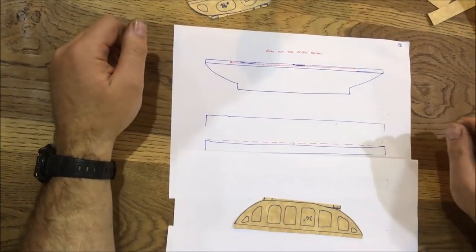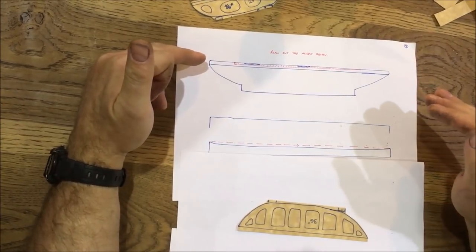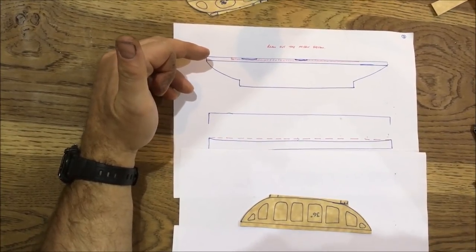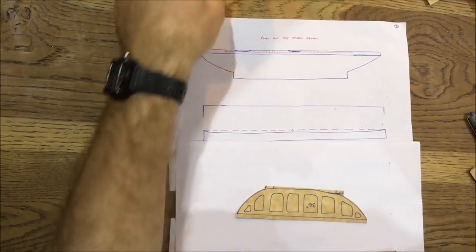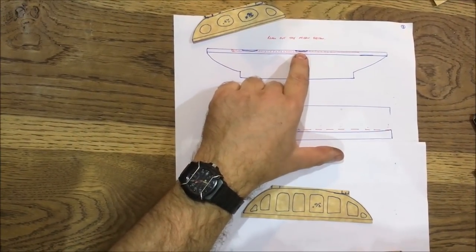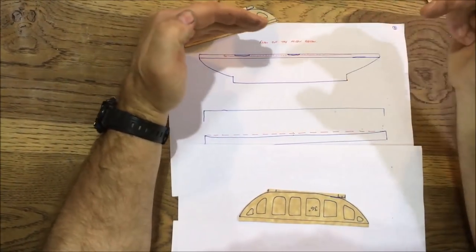What I then concluded was, I brought the end down and felt, yeah, that's looking pretty good. I then went back over it, cleaned it all off, cleaned off all the straight edges and everything, and then rechecked it with the 24 inch. And what I actually found was I'd got a hump in the middle of 3/4 of a thou. So I'd actually taken the ends down more than I'd taken the middle down.